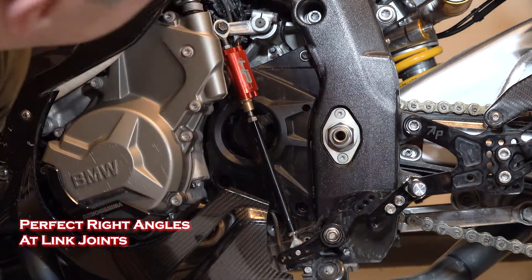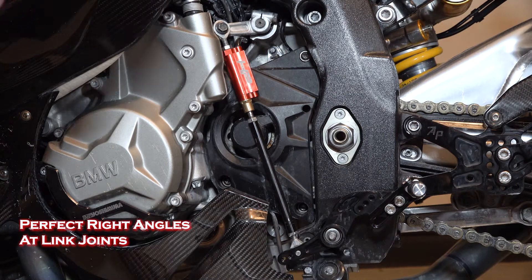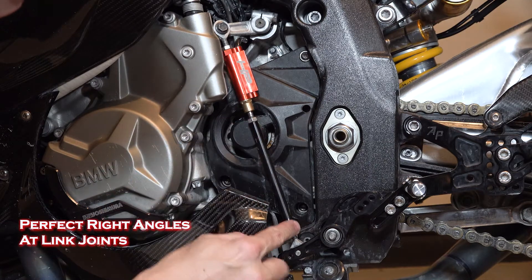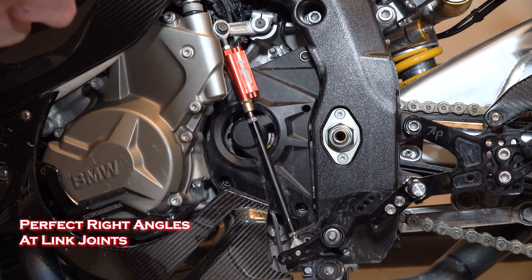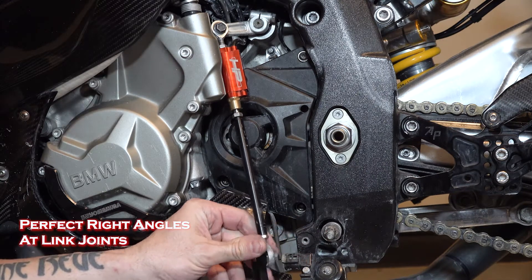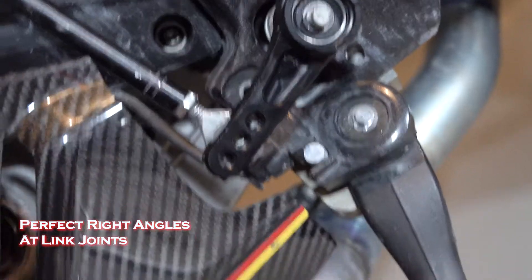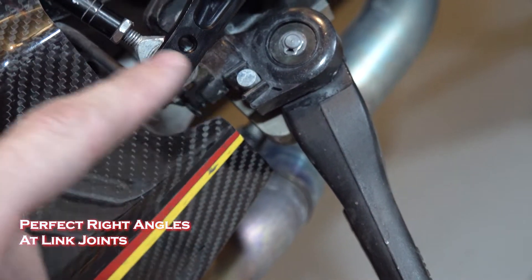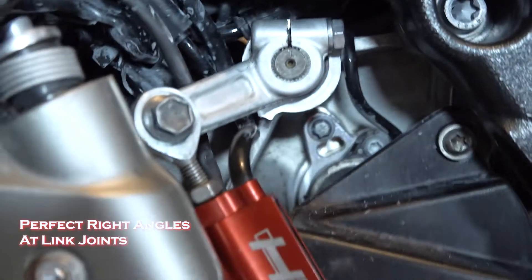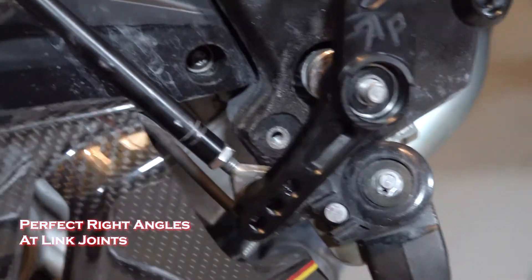First, I'm going to take that nut back off. You can see that because that angle is less than 90 degrees, we want to shorten this linkage to make it closer to 90. So if we turn that in — see where that lands us. If we move that out one notch, it gives us a little bit more moment arm here. It gets us really close to 90 degrees, and that looks really close to 90 degrees. I think that's the solution.